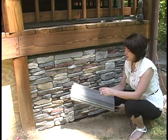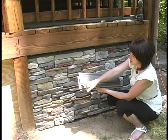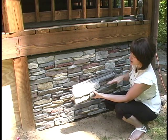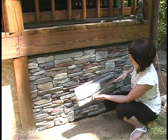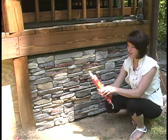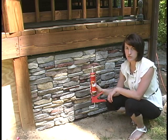We're going to take our stone and cut the bottom lock off of it. Then we're going to measure the appropriate height and cut the face of the stone to fit in. Since it doesn't have that bottom lock, we're going to use a polyurethane construction adhesive to actually attach the stone, in an area where our Superior Fit and our MSI are going to meet.